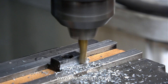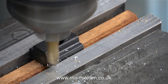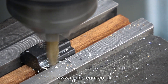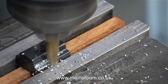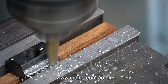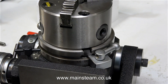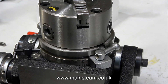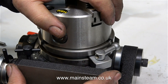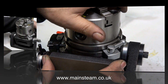I don't mind doing this because it gives me a chance to test the accuracy of my machine vise, because recently I've re-machined the top parts of the jaws which were looking a little bit chewed up. These jaws were very hard and they took quite a bit of milling — I used a 3-inch diameter face cutter which has carbide tipped teeth. So now the T-nuts fit sort of okay. The whole thing moves quite smoothly and it feels okay — it's quite firm, not rattly and not loose.